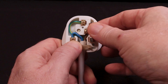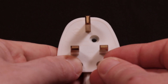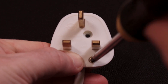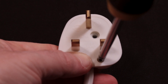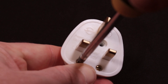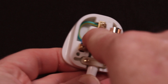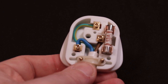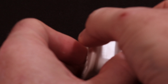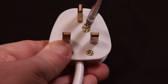It's now time to insert your fuse. I like to make sure that the fuse rating is clearly visible with the plug top removed. Insert your screws into the strain relief and tighten them up — do ensure they're not so tight that they strip the nylon from the strain relief; if that happens the plug needs to be replaced. I take this opportunity to have a quick check around the plug: make sure everything is tight, nothing is going to get pinched, the strain relief is done up, and the fuse is inserted and visible, before I put the plug top back on. Once you've put the plug top back on, insert the locking screw on the pin side of the plug and tighten up — this needs to be tight, but be careful not to strip the threads.